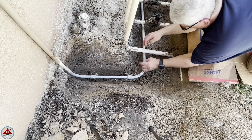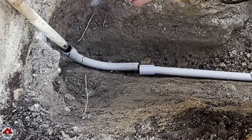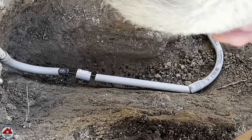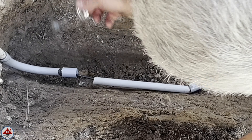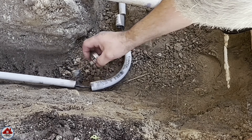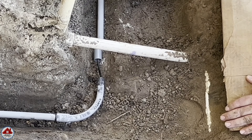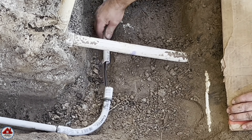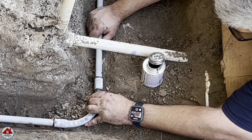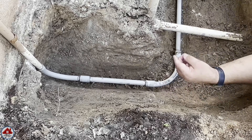Let's start cementing. I disconnect the fittings and this time I put the cement on the inside and outside of each connection to make sure it's extra secure, especially because it will be underground. This wire is rated to be buried underground, but for me running this conduit is really not hard for the extra protection — and I didn't want to have to dig up this area ever again. Any problems in the future, I'll just connect the new wire to the old wire and pull it right through the conduit. So I finish cementing my last connections and baby-wipe the excess cement off.